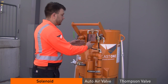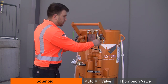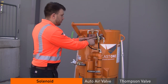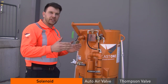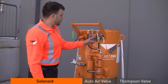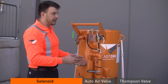This tells you that the solenoid is working properly. If air does not come out of the solenoid, the first thing you should check is your dead man handle — make sure it's working properly. Take off either the supply or the return and test the handle independently. If that works fine and you still don't have air coming out the bottom side of the solenoid, odds are there's debris inside the solenoid gumming it up. Easy fixes are to take off the four screws, pull the internals out, clean it off, replace O-rings as needed, or simply buy an Axiom replacement kit.